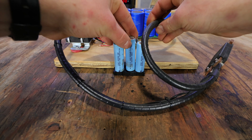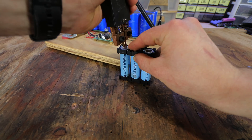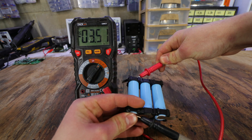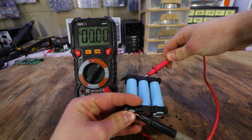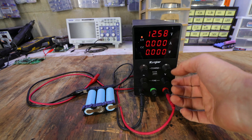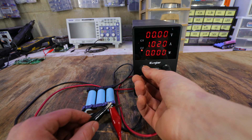I'll take three identical lithium ion batteries and spot weld them together in series. Doing this will stack up the nominal voltage from a mere 3.6 volts to more commonly used 12 volts. But before doing that, I leveled out the cells to 3.5 volts, which is basically 50% charged, and then set my power supply to 12.6 volts and 1 amp of current to let it charge up.